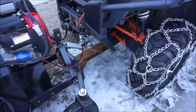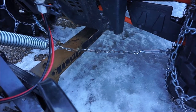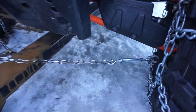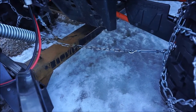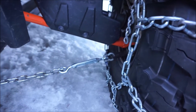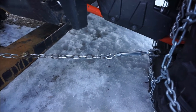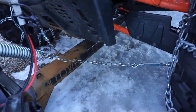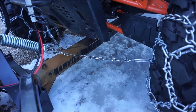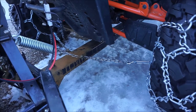A couple of issues that are problematic: the chains underneath that hold the blower centered on the Ranger's chassis originally come with a hook on the end that constantly breaks. I've replaced those with shackles on the attachment that goes to the hub and tightened them right up. The only issue now is sometimes the back eyelet bends a little and I have to take them off and straighten them in a vise. That works much better, so if you have this problem I'd change those out right away. It took me a while to figure out the best solution but it's much better now.